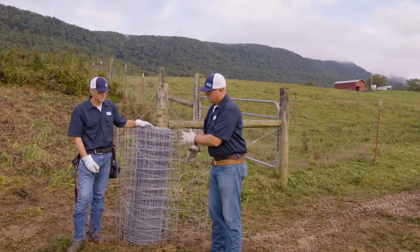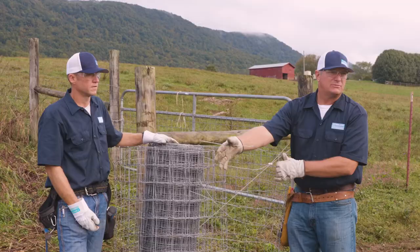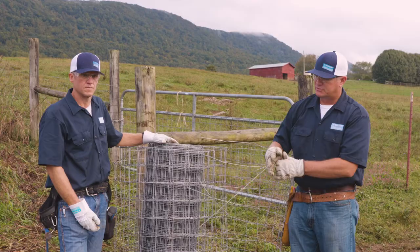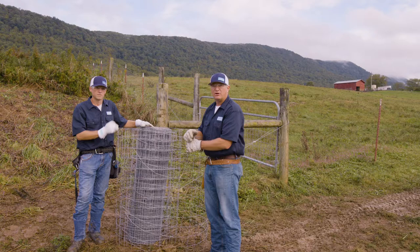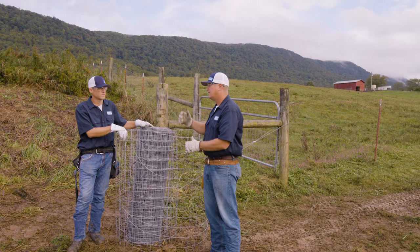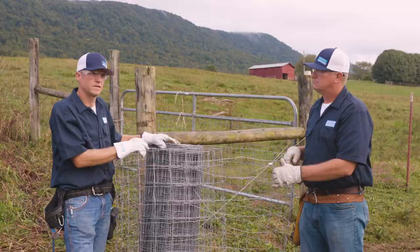As you can see, Van and I have the stays stripped away and we've got a nice length of wire to terminate on our posts here. Like we always say, good braces and posts are the backbone of every good fence build. The braces are in really good shape — Van, these t-posts are probably in at 10 feet, but you want to stay inside 12 feet. Today we're using a combination of T-posts and wood posts.